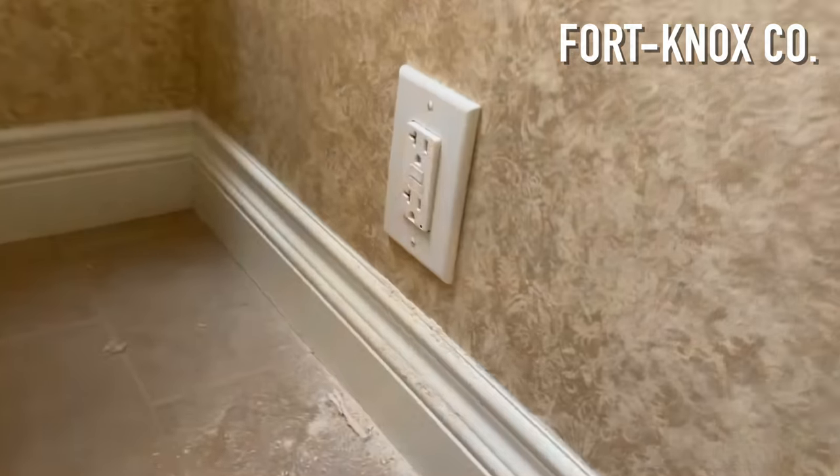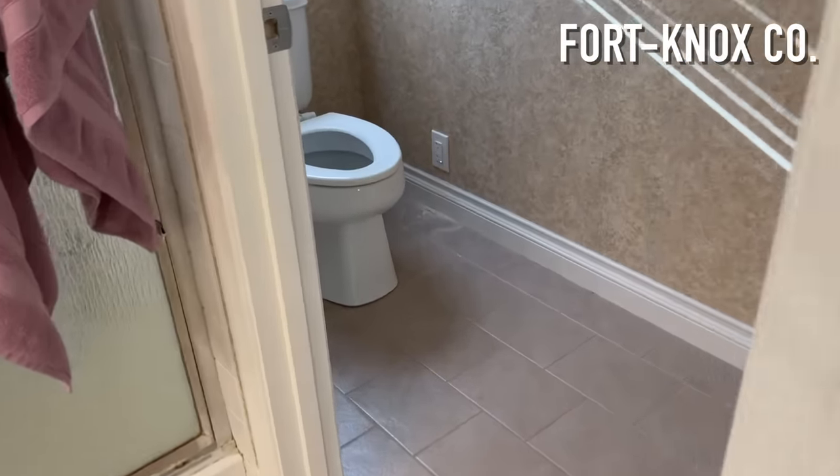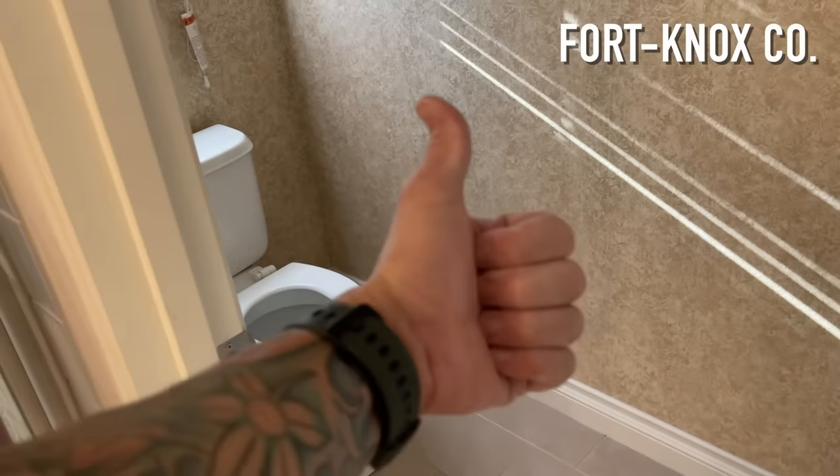This is something you can definitely do yourself. It only takes about an hour or two at most, as long as you don't have to jump across too many studs. The big determining factor on time and labor is where you need the outlet and where the original power source is. If you have to go across a lot of studs or too far down a wall, it could involve more drywall work — but it's always possible. In most cases I've seen, there's an outlet at countertop height on the other side of the bathroom wall by the vanity that you can branch off of. If you found this helpful, hit that like button, hit subscribe, and let me know in the comments below.